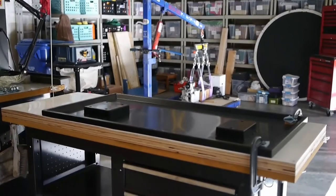Here's the location where I plan to put the lathe. It's an old Craftsman bench. I put a couple layers of plywood on top of the bench and covered that with a layer of chemical-resistant plastic. The chip tray sits on top and I have it mounted in the position where I want it. I've already drilled the holes so that once I move the lathe I'll be able to run the bolts up to secure it to the rest of the bench.